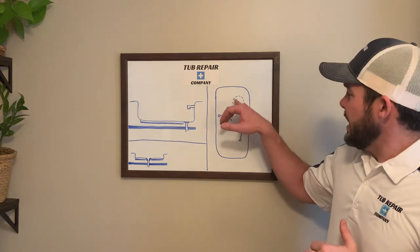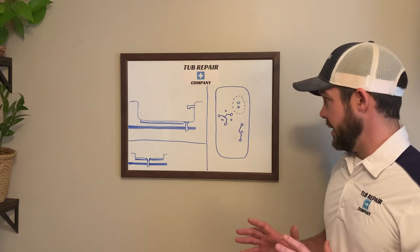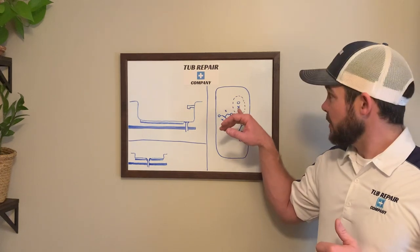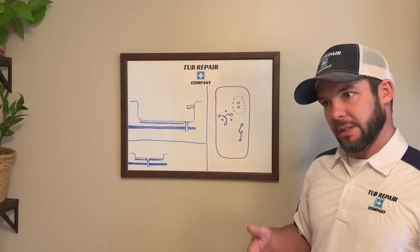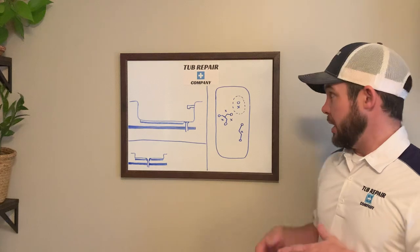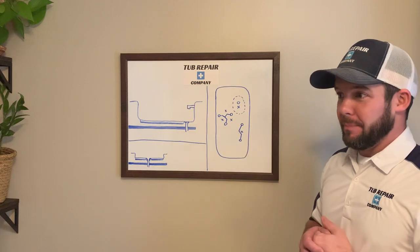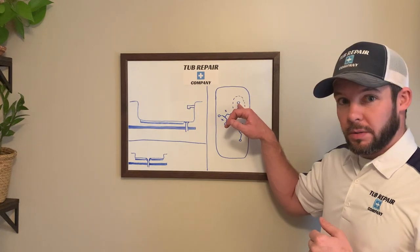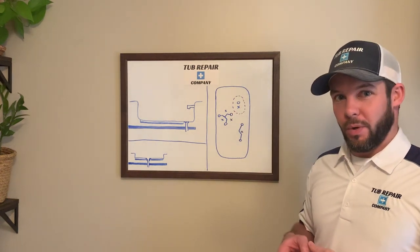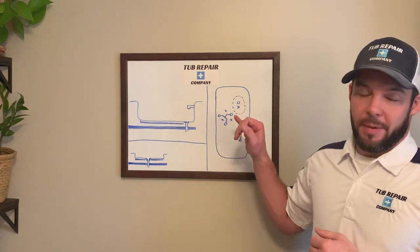If you've got a soft spot while you're drilling or adding support, go ahead and drill a hole there first. Do a deep layer support hole to get a feel for whether there's a gap between the floor and the support board, then find the subfloor and add support there. If you feel any kind of a gap, do the deep layer support hole and pump foam in, but also do a shallow layer support hole — drill down to that support board and try to get foam into any gap there as well.